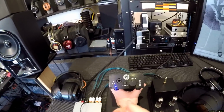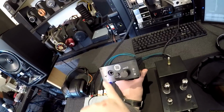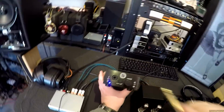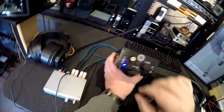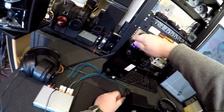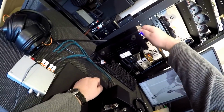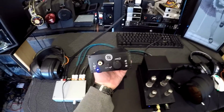And the thing is, you can't even plug a full Neutrik connector into it because it's recessed. So it's just for a 1/4". And the reason that this is shoved in there is because this connection is so tight. I usually would just swap out 1/4", everything would have a 1/4" and swap out 1/4". But it's so tight, I could hold the unit up by the 1/4". It's too tight. So I'm leaving it in there. I'm gonna swap the 3.5 millimeter.